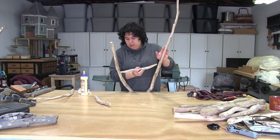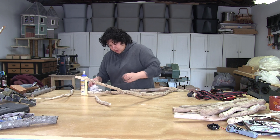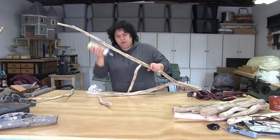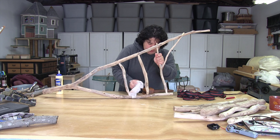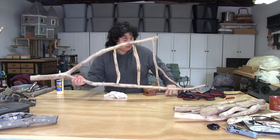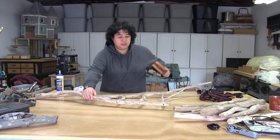Did I put that in wrong? Maybe I did put it in wrong — not enough coffee in the morning. I'm going to try and work quickly here because I can't get that strap clamp on until I get all of them into where they're going. I do not want this glue to harden on my piece because when I go to apply my finish, the glue will act as a resist. Especially since I am not intending on sanding this piece — I want to leave the markings from the shaving on it.